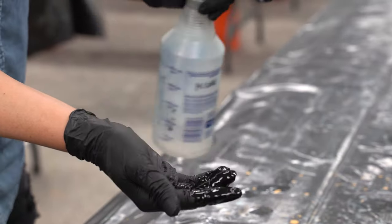I waited about two hours to scrape the drips, but that was mostly due to the timing and temperature of my pour. Just watch, and as the drips stop dripping you can start scraping — you can scrape it multiple times, it doesn't hurt anything. Pretty soon you'll notice there's no more drips coming down. I'll probably come back in five minutes and do this one more time. Right now you might find a little bubble or a fish eye you just missed in the main coat, but the product is still pliable. I can take alcohol and massage a little imperfection or bubble away. If you pull your masking as soon as the drips stop, if anything got on cabinet faces or whatnot, you'd have time to take some alcohol and gently remove it rather than letting it cure the next day.